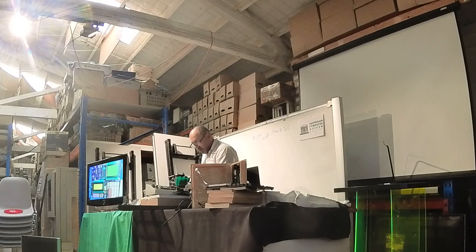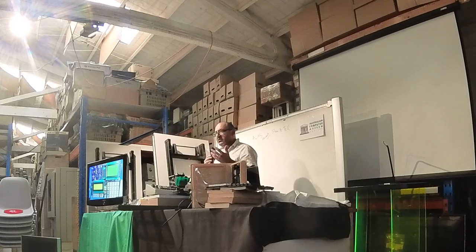So C3 0640, okay, home and go. And you can see here, it's just cycling through from 0 to 255. So you can see how, as a developer, I can just play with it, I can look at the breakpoints, I can also interact with the monitor. There's about 45 different monitor routines that we can actually interact with. That was just one of them.